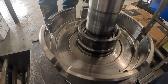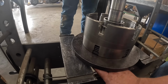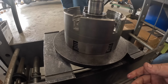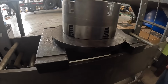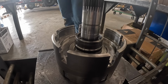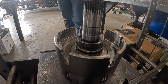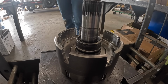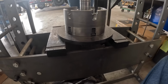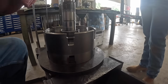Yeah. All right, double checking. We did take a snap ring out of there. We've got everything set up here. I believe we're good to go, aren't we? You ready? Yeah. Kind of watch the tonnage and make sure we don't get too much on it. There's five. There she goes. Hang on, let me watch these clutch plates here too. Okay.